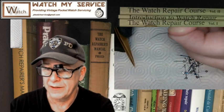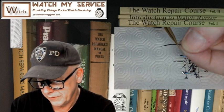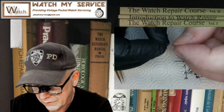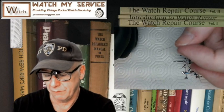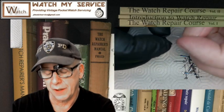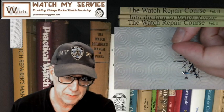There — that watch hand is bent. Now when a hand is bent this way — the flat way — the material it's made of means you can simply grab it and bend it back. If you're brave you just grab it with your hand. It's kind of the same technique as adjusting a balance to get it perfectly flat and round, using your fingers without applying any heat.